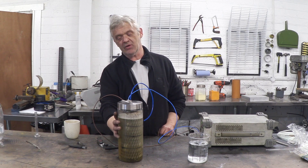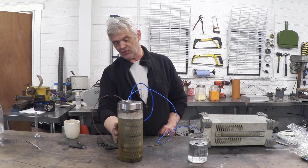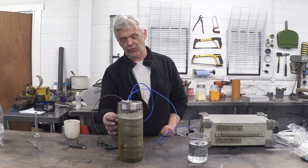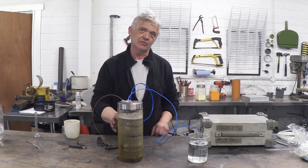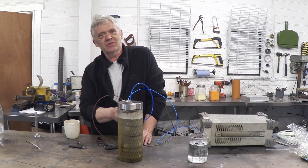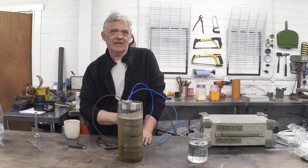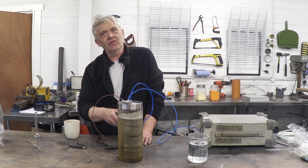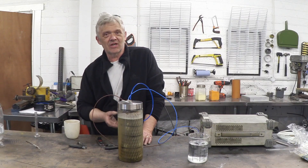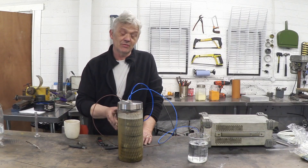What you can see here is a hydrogen generator — it's actually an electrolyser — and you can see it giving off lots and lots of hydrogen gas, which is what all this bubbling in the liquid is about. I'm fascinated by these, but the challenge with them is actually making them, because you have to make those plates out of stainless steel, and all that mucking around with stainless steel — cutting the plates and drilling them — is really quite challenging to do with home tools, especially with stainless steel.